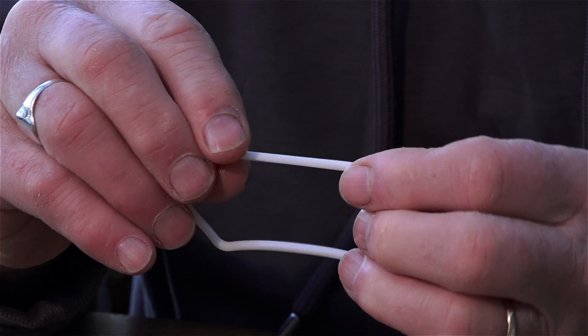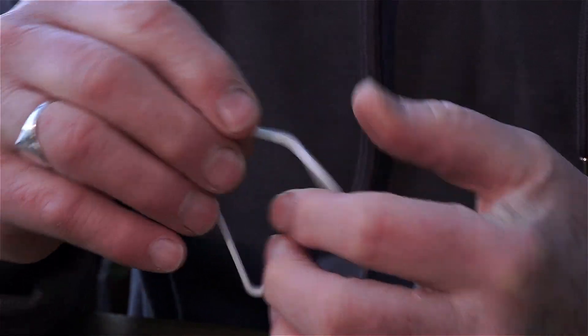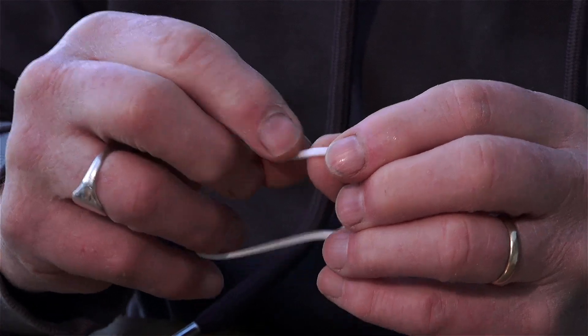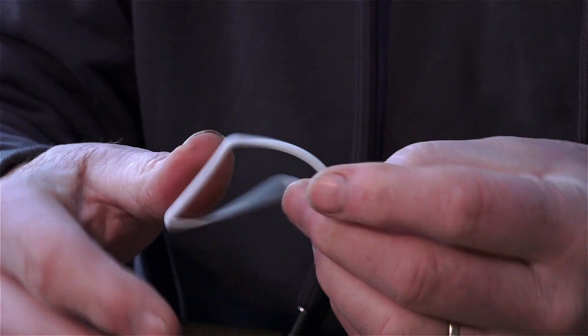These are what we'd call dry o-rings, though not totally dry — I'd use just a little bit of saliva, run it around to give that little bit of moisture. That's actually a good way of detecting any particles on the o-ring as well: lick your fingers, run the o-ring smoothly through them, and you can feel any particles that are there. Once satisfied it's clean, have another careful look to make sure there are no nicks or tears in it.